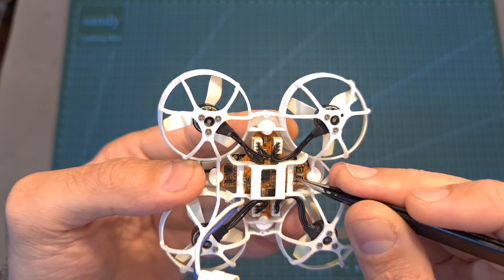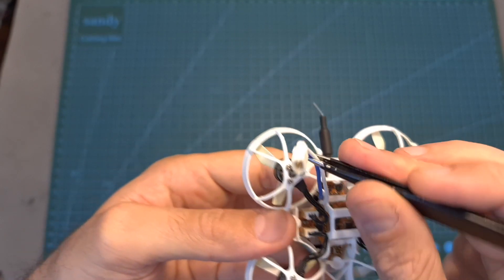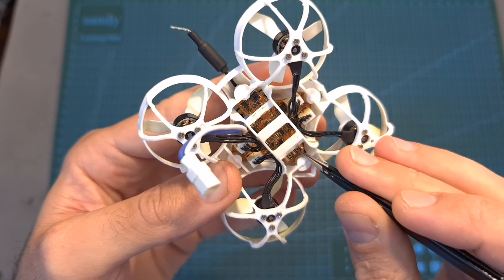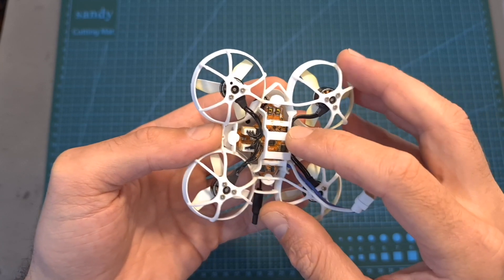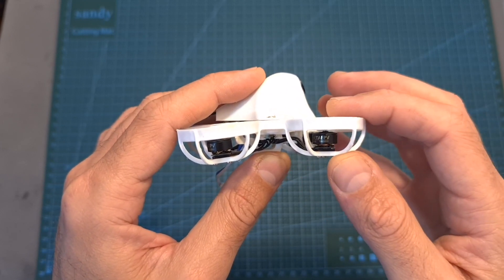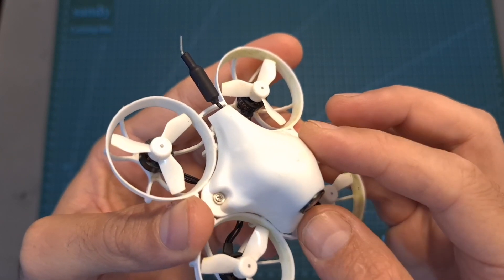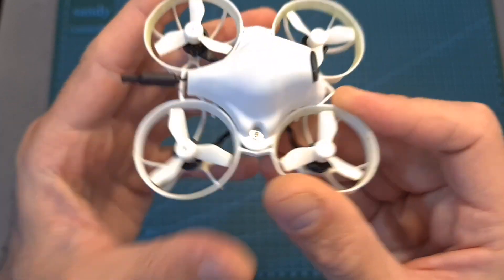By default the built-in FrSky D8 compatible onboard radio receiver is in use. Entering bind mode is done by pressing the bind button while powering the quadcopter. If you would like to add an external radio receiver, you can switch between DSMX and SBUS modes by pressing the FC button while powering on the quadcopter. In terms of specs, the all-in-one flight controller features an integrated 5A 4-in-1 ESC. The Meteor 65 Lite features 0802 19,500 KV motors and uses the BetaFPV M01 all-in-one camera combo based on a 600 TV line CMOS camera with a 40-channel 25 mW video transmitter that supports smart audio. It uses a BT2.0 battery connector and features a very flexible, durable frame and robust canopy.